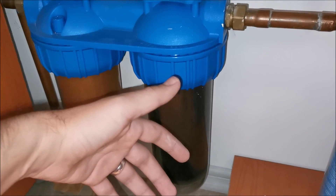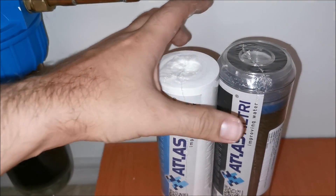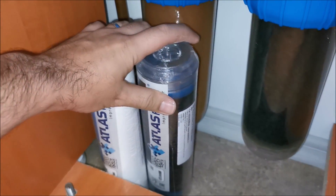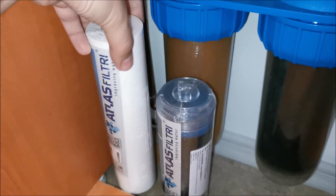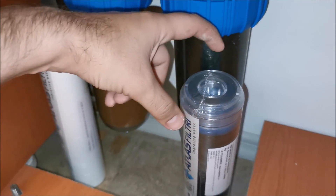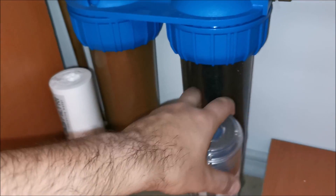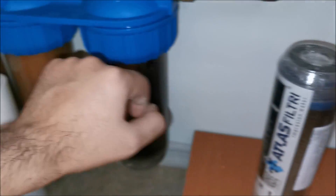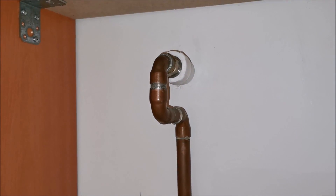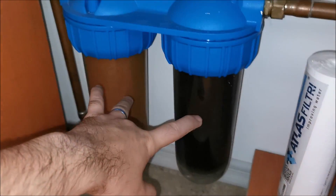When I get close to running out I'll order again. The new setup will be: one combination filter — filtering particles and chlorine — and one carbon-only filter, so two filters with overlapping chlorine removal. It's not simple but I don't want the pipes to be affected, because replacing pipes inside the walls of the whole house would be a nightmare.